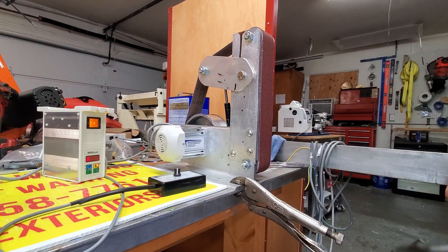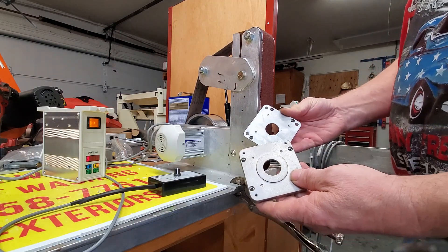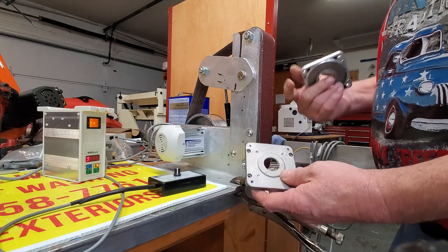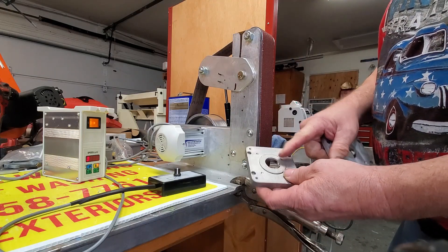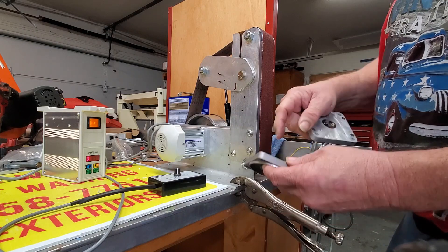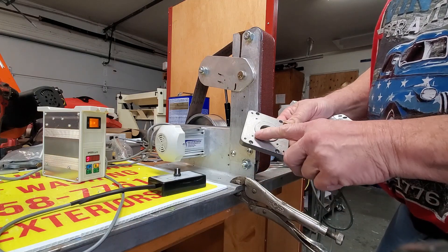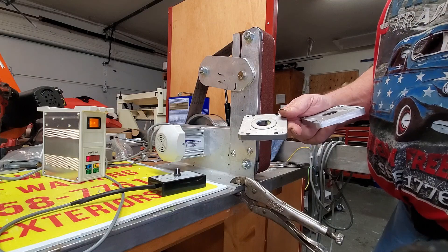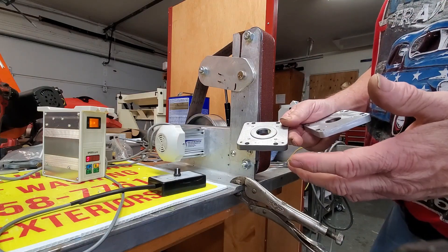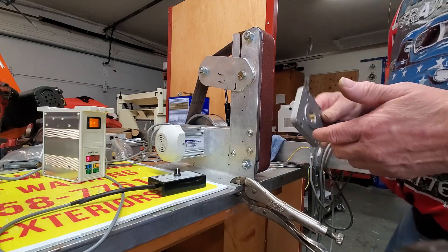I use version two of this to surface the face plates of these motors. We actually have a new face plate coming which is thicker and better than this. Normally I will take this in the milling machine and take most of this off, and then surface it. This is two millimeters thick — we're going to see if we can surface two millimeters off through this face plate with just the grinder. It's probably going to get hot, so if you see me stopping, it's just to go put it in the water and cool it down because it's too hot to hang on to.